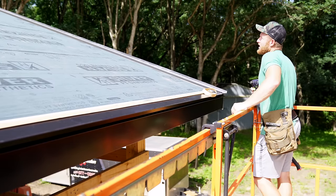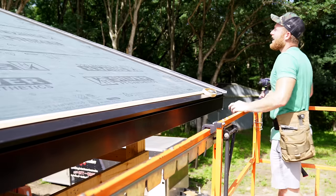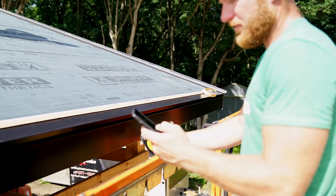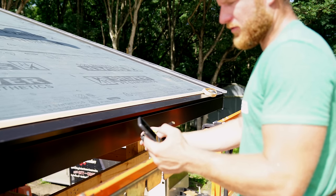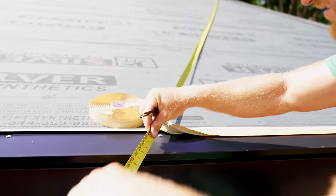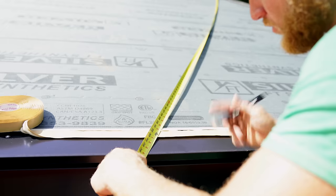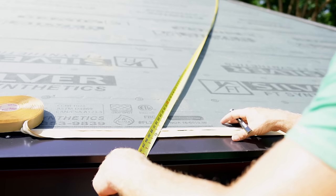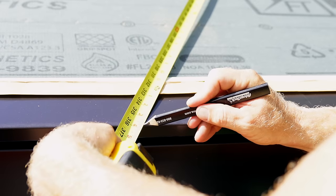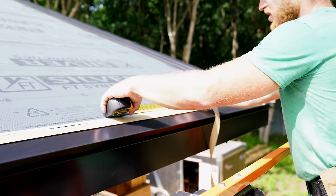I'm going to confirm square by checking off of this eave to your edge and my edge. If we need to cheat it into square we could do it a little bit at a time. Ten foot run, 23 foot 3 inch... 25 foot 3 and 11/16. Double bead mastic - 26 foot 3 and 11/16. We're off a foot - oh wait, that's right, you're burning a foot, so we're exactly 26 foot 3 and 11/16. That's nice.